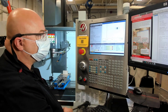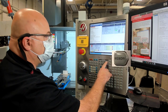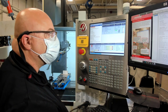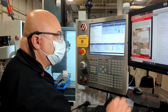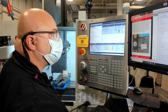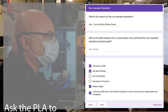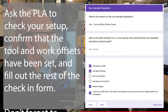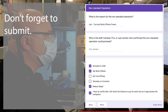Once you've simulated on the controller, we're going to go back to Memory again and hit Current Commands. Then we're going to reduce the rapid rate on the machine tool. At this point, we're going to have you ask the PLA to check your setup because you're almost ready to press Cycle Start and run the program. Fill out the rest of the form and don't forget to click Submit.